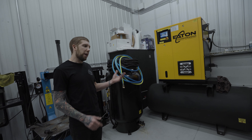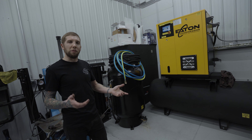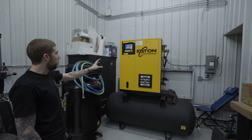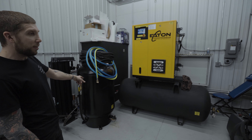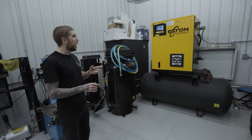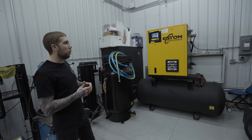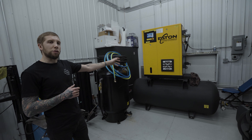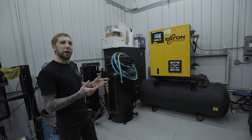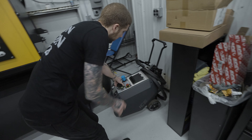Dry ice blasting is just a safer way to clean — you don't have to worry about using chemicals or water near electronics. You can also play with the settings on the machine for delicate stuff, where with a pressure washer you can't really do that. This is the compressor — it needs a rotary screw, this is a 20-horsepower unit. It goes to a wet tank, through a desiccant dryer, and then to a dry tank. It's very important to have a lot of volume and dry air — desiccant works really well for that, and a rotary screw compressor is designed to run a high-duty cycle without really taking a break like a piston compressor would.